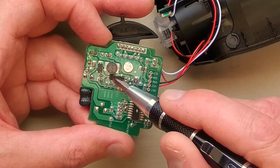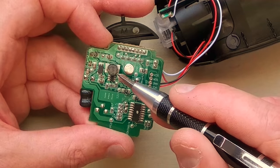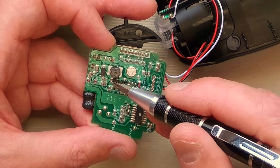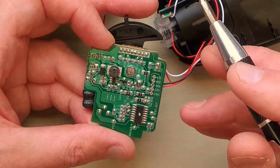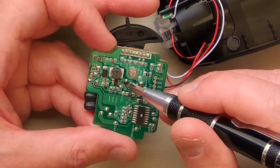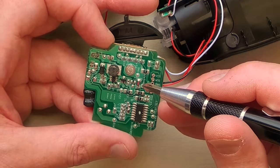There's a little boost circuit here — I think it's a boost circuit — which has a 4.7 microhenry inductor. That is labeled B6287, this chip here. There's also a little chip next to it that seems familiar; I couldn't find it on a short search. It's marked ASHB — looks like a transistor. I'll have to check that in more detail later on.